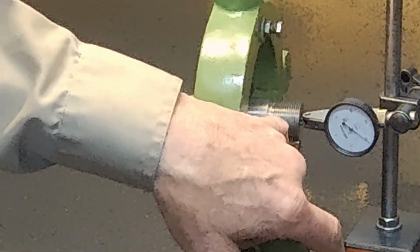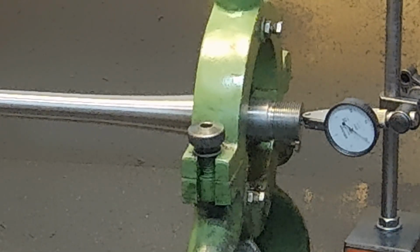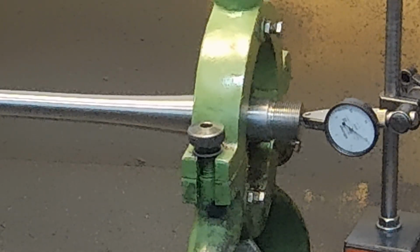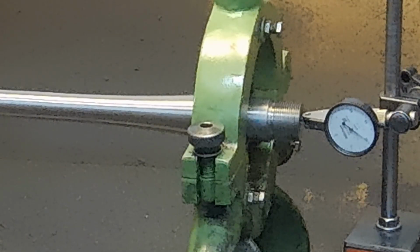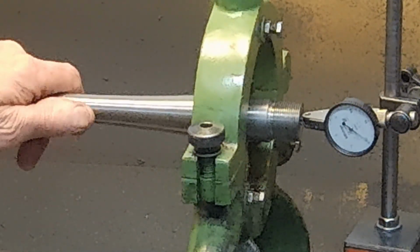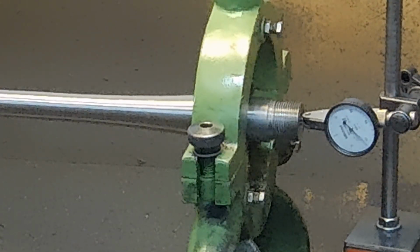I've gone ahead and roughed the chamber to a depth of 1 3/8 with a twist drill, 15/32, pardon me. 15/16 would be just a little big. So 15/32. Now nominally, that drill would drill roughly 0.468 or 469, and sure enough, that hole measures 469. So that's pretty good.